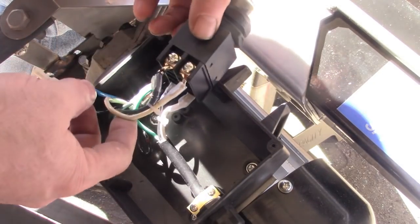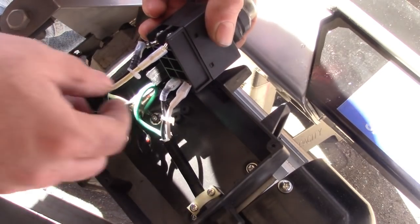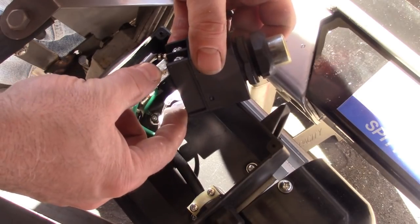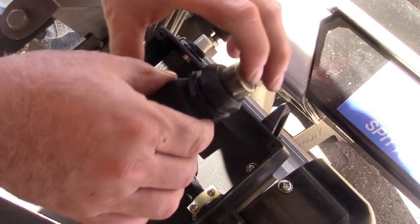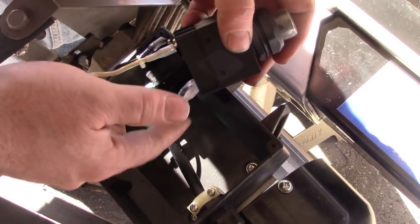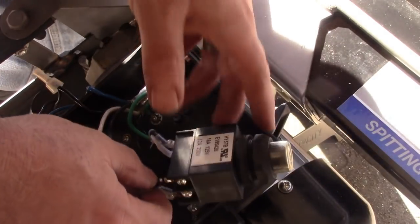I've got this switch here — it's got the power cord coming in, a hot wire, a ground wire, and then I'm assuming the white and the black are the hot wire and the neutral. It would be white to white, black to black if it was just a continuous circuit. With switches like this, all you do is interrupt the hot feed and wire the switch into that. So I'm thinking I may just wire the two white wires together and run the black hot wires out of the box over to the new switch.